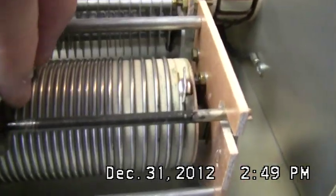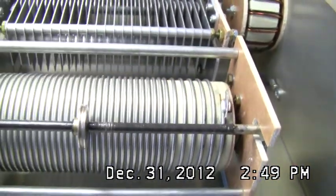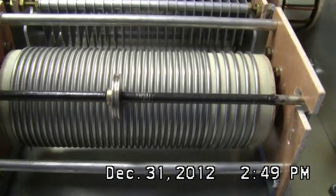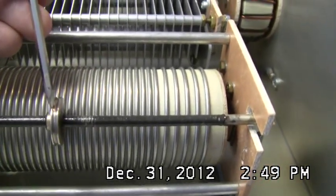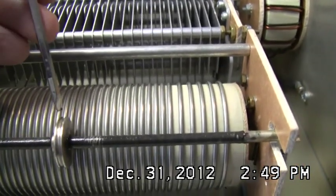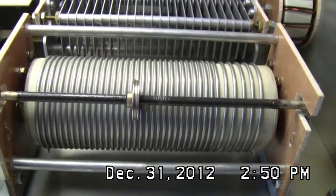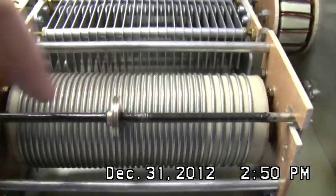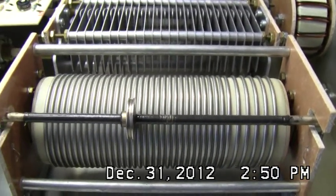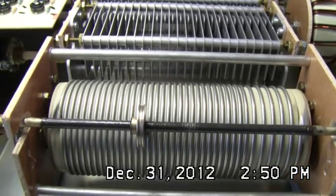One more thing — you want to make sure this wheel here is clean on the inside. Put a rag on there and with the other hand crank it around, making sure the connection right in here is clean of all dirt and grease. That actually makes contact on each side of the winding for good solid contact. This mechanism makes two contacts on each winding as it rolls, so if one side is bad it doesn't matter because the other side makes contact.